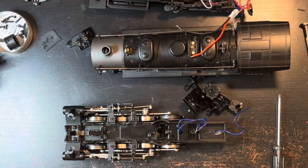So what happens now? I'm waiting for the motor. I'll get that motor, test it with straight variable DC, then attach it to the board and test that. And if all's good, I'll put it all back together. And if it runs well, I'll then consider putting in the cab light and/or firebox glow, or trying to figure out how to add a backup light or marker lights or something like that. But for now, I think I'm in a good spot. I'm pretty confident this will work — I just need to wait for the motor.